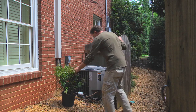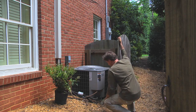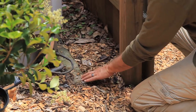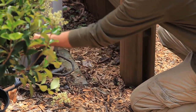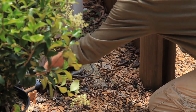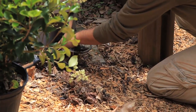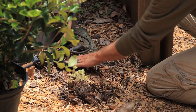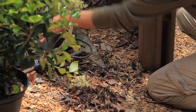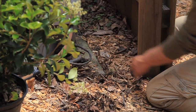One good example of what you really do and don't want to do: at the bottom, you always want to keep this concrete exposed and you never want to pile a lot of mulch up around your unit, because this material holds moisture and you're going to get a lot of rust. It can wear on the system over the years and cause it not to live its full life. So keep this mulch away from the air conditioner unit and keep the concrete foundation exposed.